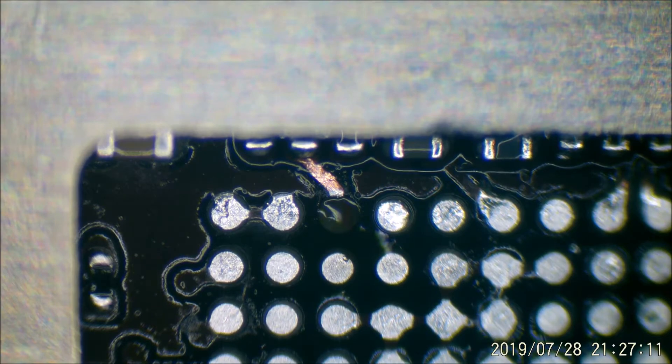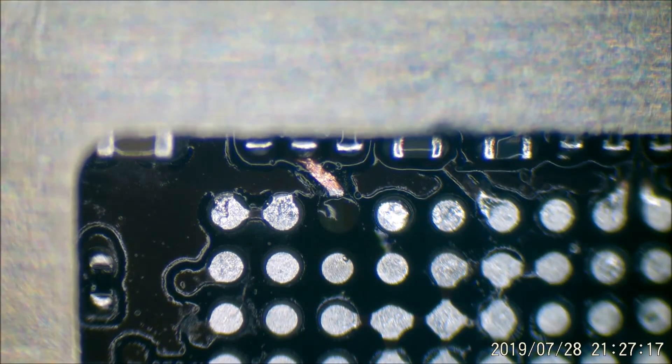C12 is the main culprit. I'll put a bit of flux on them and try to tin these four main pads, being a little aggressive with the iron at 350 degrees, just to see if any of them will come off. This phone is in very good condition — those three are very stuck on. But as you can see, C12: a light tap and it literally falls off onto the iron with absolutely no effort at all. So I'm confident F12, H12, and J12 are absolutely fine — it's just this one. I'll tin that trace and get a bit more solder on.